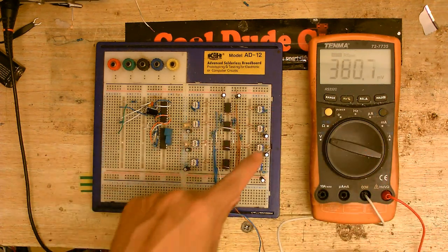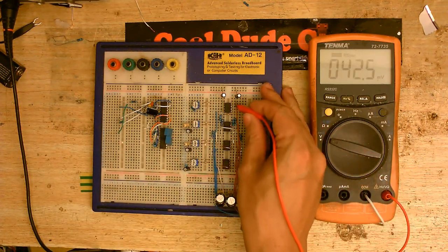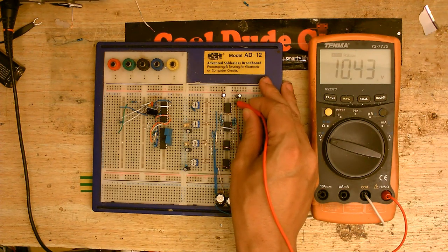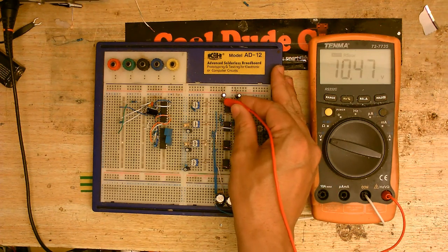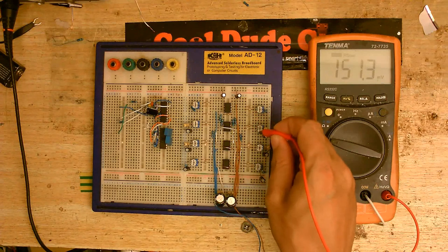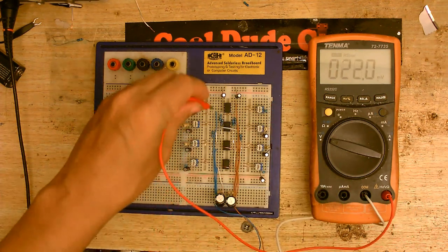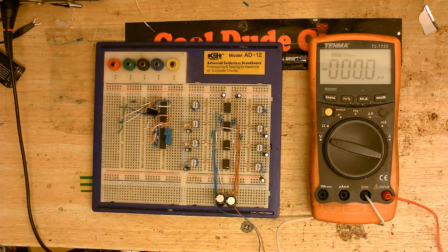You may have noticed that I've built two of everything here, because we want stereo. Let's see what we've got coming out of the final op-amp. 10 volts? Well, that's not right. The other channel is also 10 volts. What's coming in? 5.9 volts — that's what it should be getting. So why are we getting 10 volts coming out? That one is where it should be.